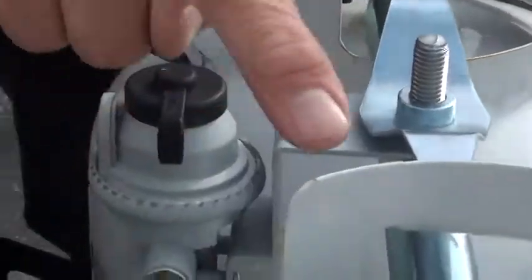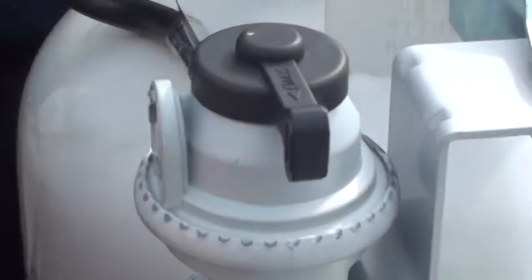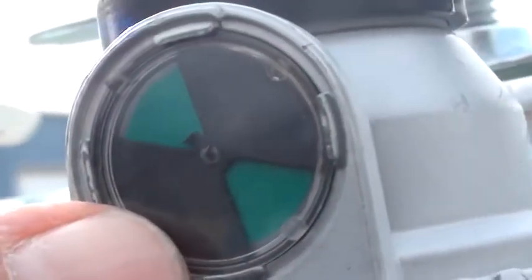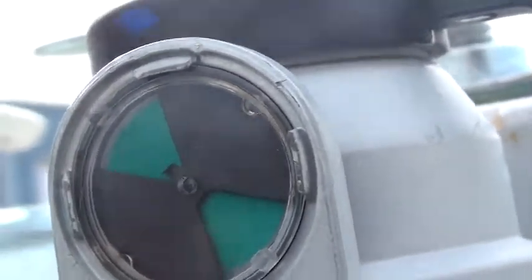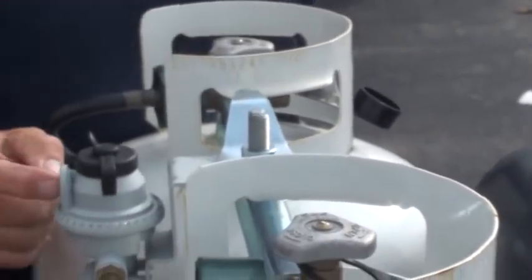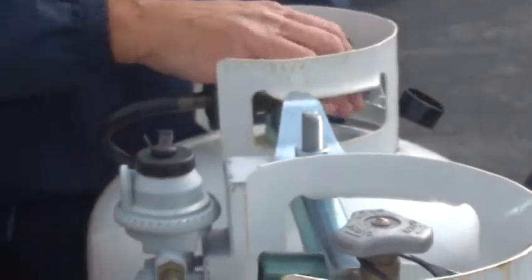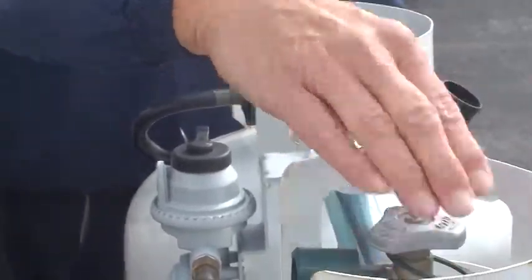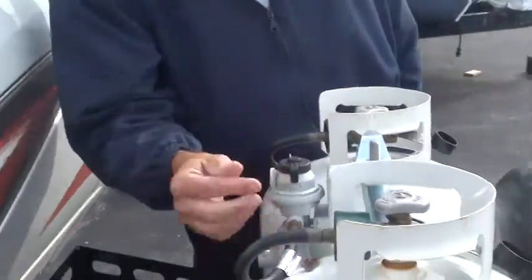This physically indicates you're drawing from this side, and when this tank runs dry, this little cross back here will go from green to red. When that happens, the regulator will automatically switch to this tank if it's on. A lot of campers like to camp with this one off — that way they know when they're out of gas here without checking constantly. When it turns red, they'll flip this one on and turn this one off, get it filled, and that way you'll never run out of gas. So we'll flip it back to the one that's open.